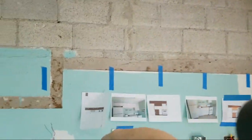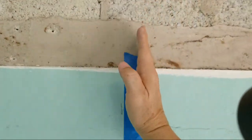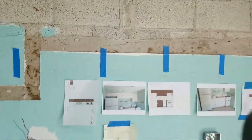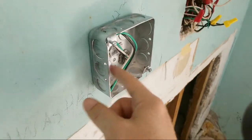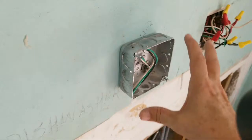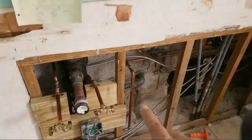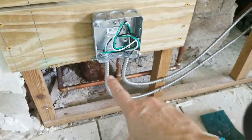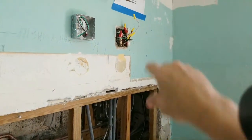What we decided to do is frame it out. Where all of these blue stripes of tape are will be vertical studs or furring strips. We're going to lay the two-by-fours flat on to the concrete and tap-con them in. That will give us a little crawl space, as I call it. We attached right onto the brick wall here on the outside — that's our counter outlet along with the switch for the garbage disposal. The garbage disposal and dishwasher will both plug in right here. We're using flexible conduit that goes up into the brick wall and into the laundry room where the panel is.